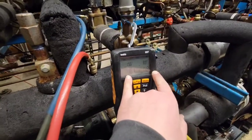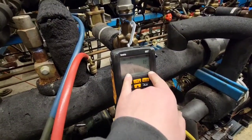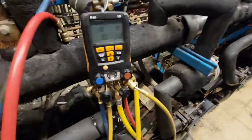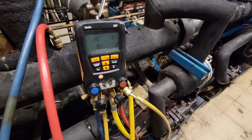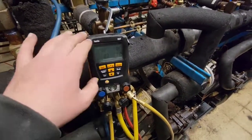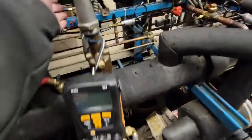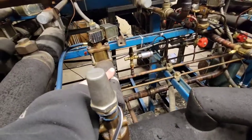You can see that this is too close — I don't like that. I want at least 10 PSI between my EPR and my suction header in order to properly set. Some people will say it's 5, I'm going to say it's closer to 10. It depends on the valve. This valve size might have a pressure drop across it of 10.